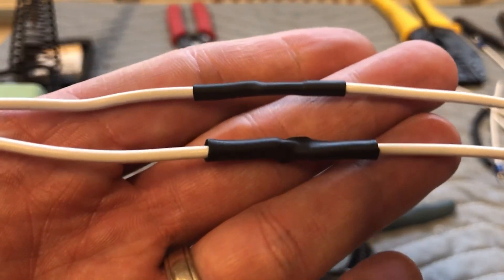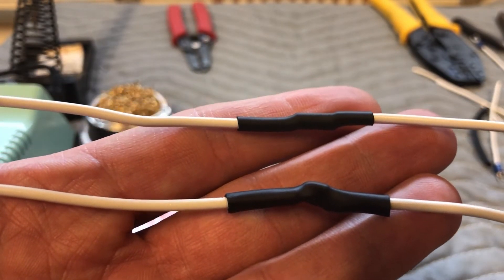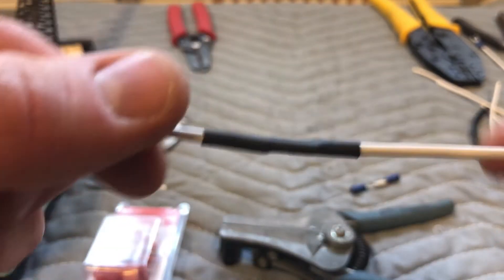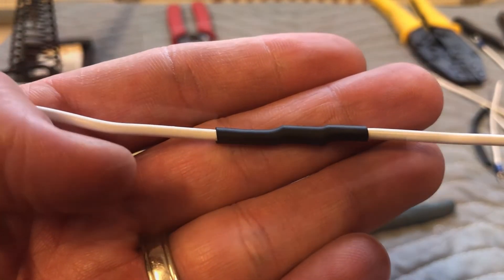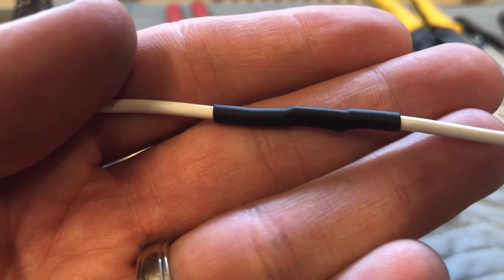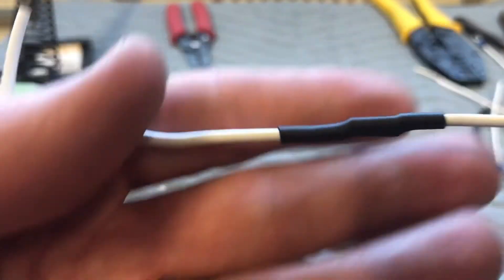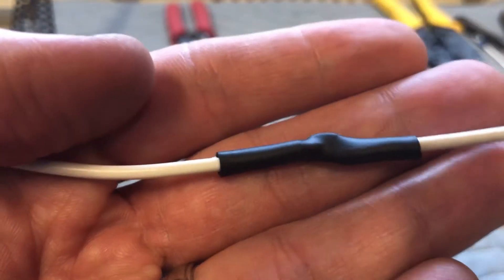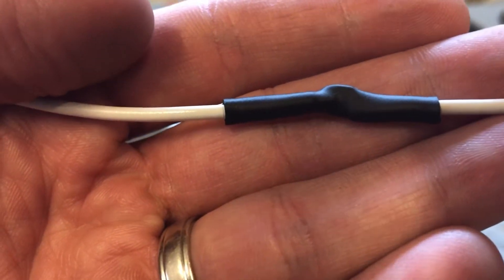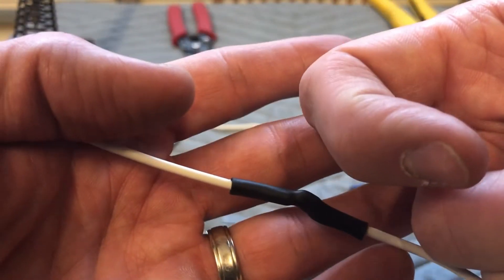Here are the two types finished with heat shrink. The overlap lap joint has a very low profile — it won't catch on much because it's almost the same diameter as the jacketing. The downside is if you have a cold solder joint, it'll snap and pull apart since it's just a lap joint. The hook joint does better with cold solder joints because the two hooks are more structurally sound — they hold together even if the wetting wasn't perfect.